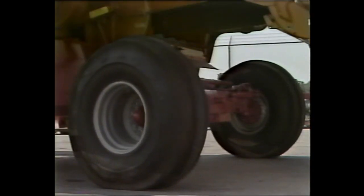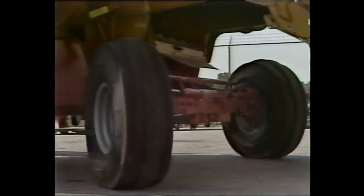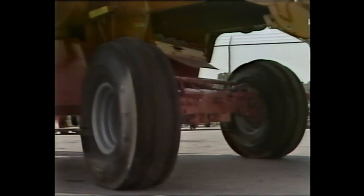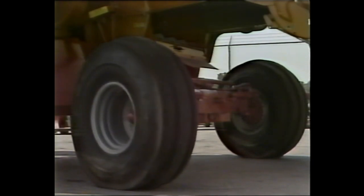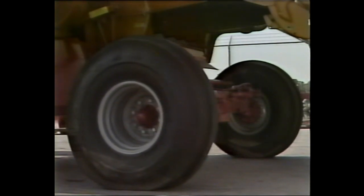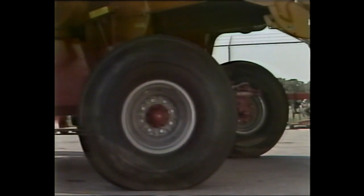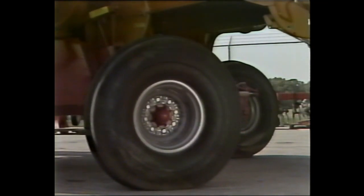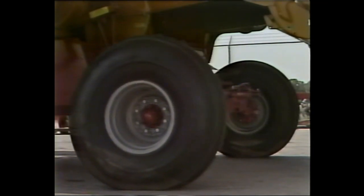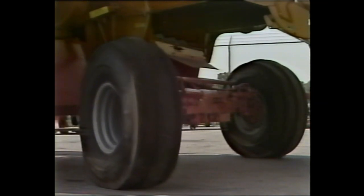Check your adjustments by again turning the wheels full left and full right to see if the lugs now make contact with the stops as they should. If they don't, continue to adjust and check the wheels. When the wheels are set so that their travel is equal, refer to the operator's manual for correct tire pressures and measure tire pressure and set accordingly. Proper adjustment of a combine equipped with tracks can be found in the MF Combine Setup Manual.